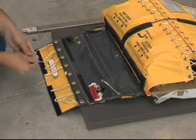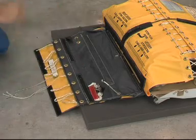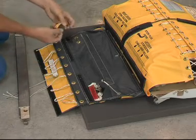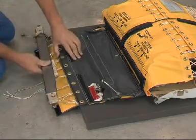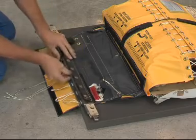Install a temporary tie on the small cord loop. Install the mooring line on the left side of the girt bar and place the girt bar between the short and the long girt extension flap.